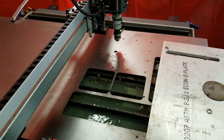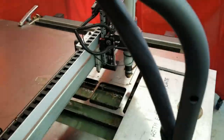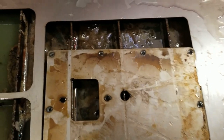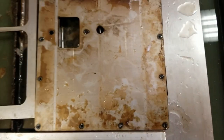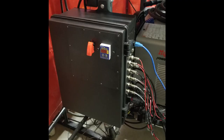I'll make you sit through watching all those holes get drilled at normal speed. Just amazed to see how well this cuts the 16-gauge — no dross on it at all. I'm going to flip it over here. All the discoloration on the back I think is from the cutting fluid — it's pretty dirty and sticking to the back, but it just wipes off with a rag and left a pretty clean surface underneath. One thing I noticed was my inside cornering on the holes for the Proma SD cutout wasn't quite right — three of the corners were really rounded and I had to come back and hit those with a file to square them up. Here's the finished panel; I think it turned out pretty good.